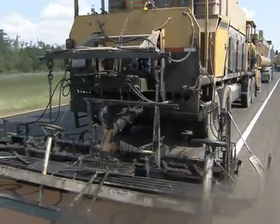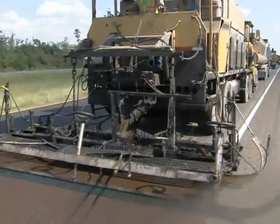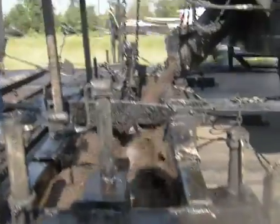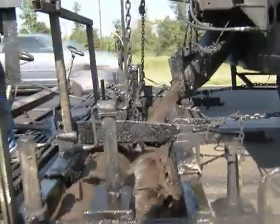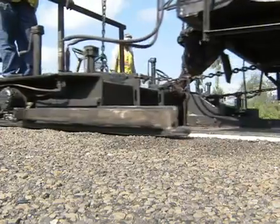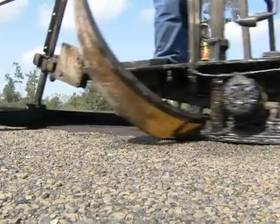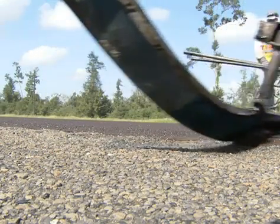In Lufkin we can't afford to use as much hot mix as we would like, so we basically use a lot of microsurfacing. We use it to cover up slightly rutted flexible pavement and restore a ride. We'll also use it on roads that have somewhat of an issue with bleeding seal coats, and sometimes as a scratch course to fill up ruts in a single lane.